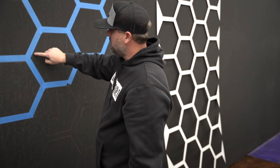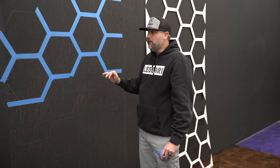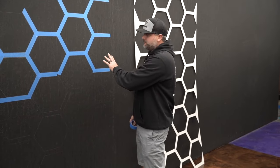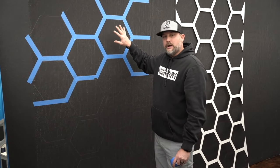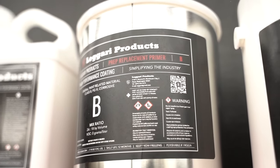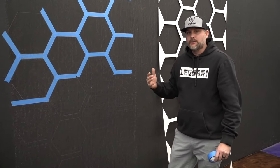When we coat this, all the pencil lines inside the blue tape are going to be covered by the overlay. If you have a painted textured wall — say a white painted wall — and you want white grout lines, you can do your pattern on that painted wall just like we did here. Tape off your pattern, use our prep replacement primer to lock everything in, and that gets you the bond between our overlay and your painted wall. Our overlays can go right over textured painted walls, drywall, sheetrock — anything.